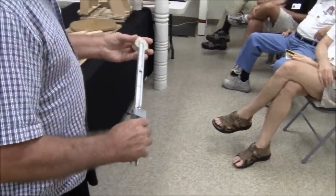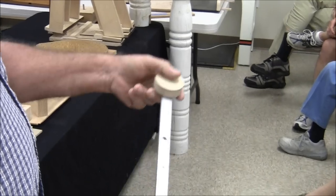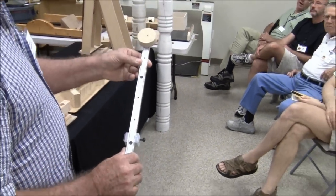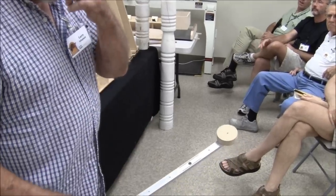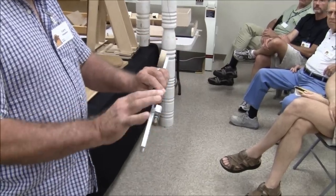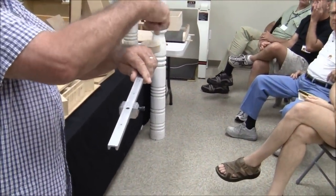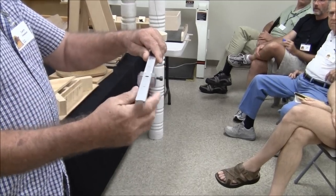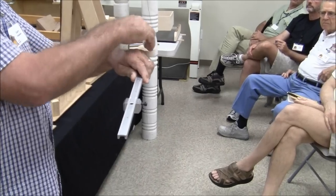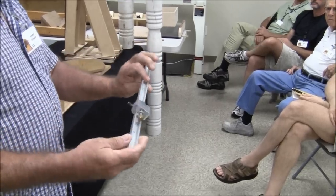This here, I needed to make circles one time, and I decided, well, if I'm going to make more than one, I need a jig for it. So I just took a strip of bar stock that I had, and I've got a groove on my sander. So this, of course, could slide in the groove up toward the disc. I made this little bar piece back here so that I can adjust it. I can put it in any position I want, then fine-tune an adjustment. The end of this here would push on the bandsaw table and stop. Of course, that relates to what diameter I would have here. And I can make a fine-tune adjustment if I wanted to establish a certain size. And then I just repeat it, just put a screw in the bottom, a whole bunch of them at one time with this setting. So that's all that was.